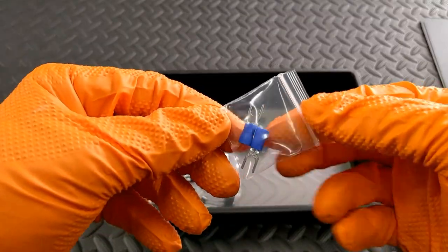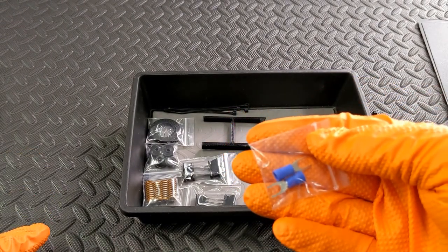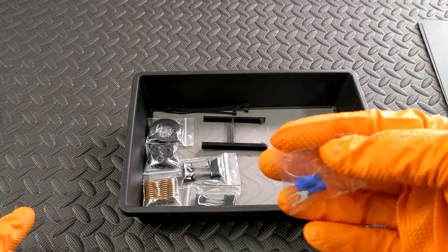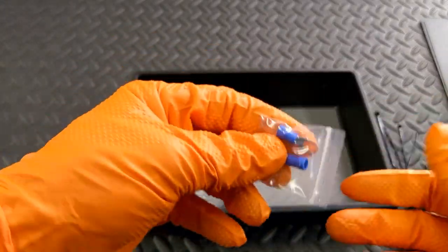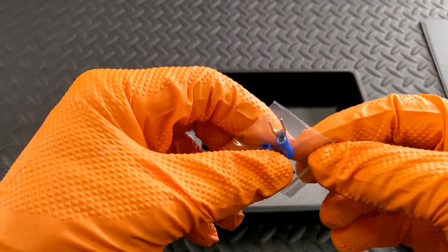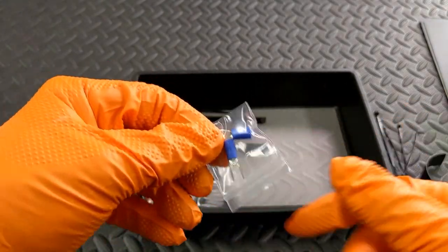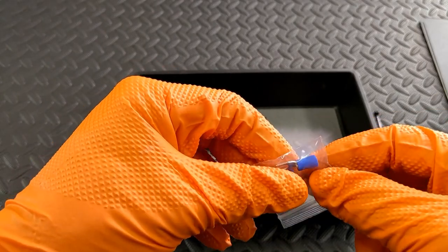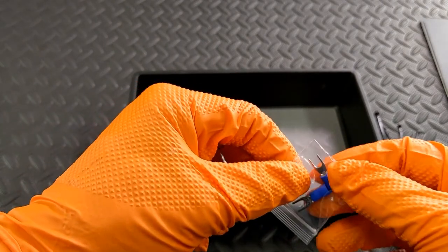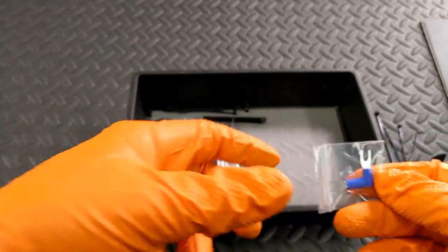This is for the heater wire. If you choose to shorten the cable, the cable that comes with it is 36 inches, plus or minus a couple inches - on average about 35 to 36 inches. You can crimp these connectors if you have the proper tool. Or you can try to crimp with pliers, but make sure the connectors are secured - maybe add a little solder to help hold it in place. Use heat shrink or tape to prevent anything from touching.